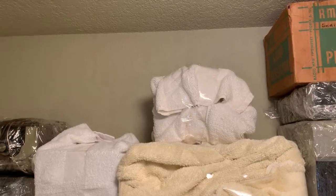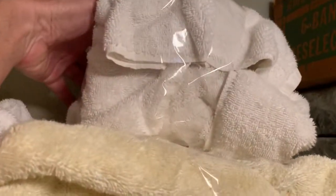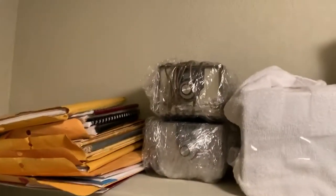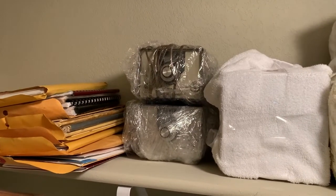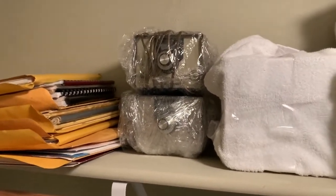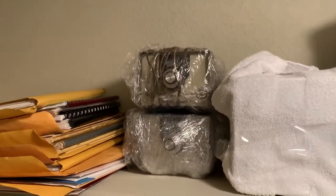I don't know what that is. That may be that Mars Mobile. Oh yeah, that's that Mars Mobile transmitter is what that is. I still got to work on that too. And there's those, oh God, what are those? Oh yeah, these were those expander VFOs that used to modify the old CB so you could use them on the extra frequencies, but they're great for 10 meter conversions. They're awesome for that. They work fantastic for that. So that's why those are up here.